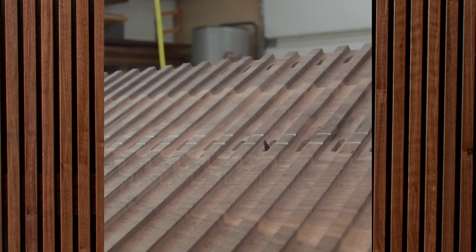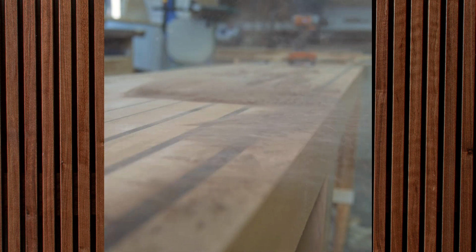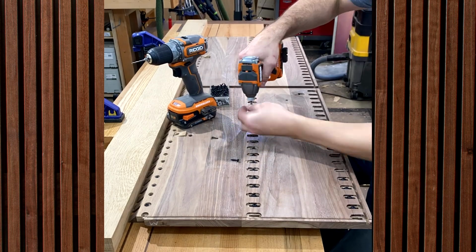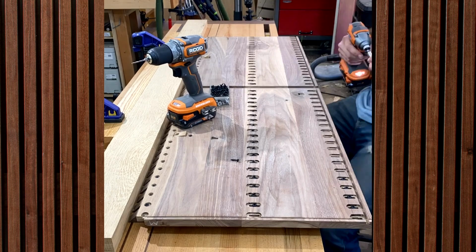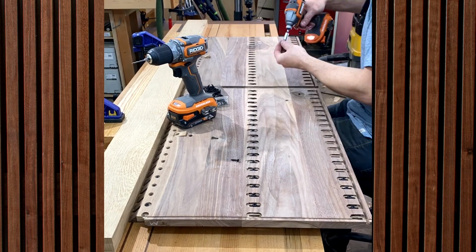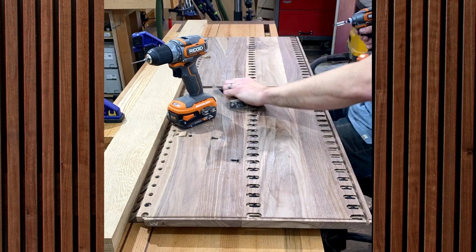And then, since they're piston-fit drawers, each one of these attachment points had to be counterbored on the inside to allow the drawer to pass by. So you can see the fixed point is up front by the miter. That'll maintain that gap, and then it'll float moving backwards in the case.